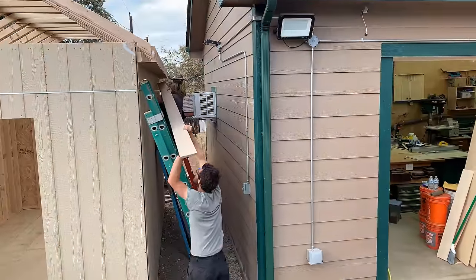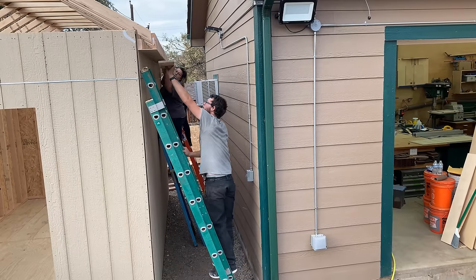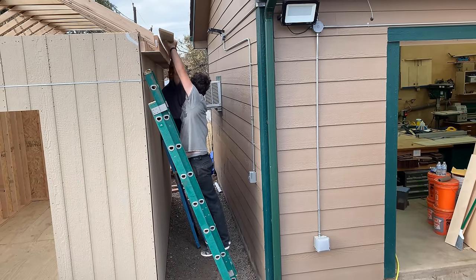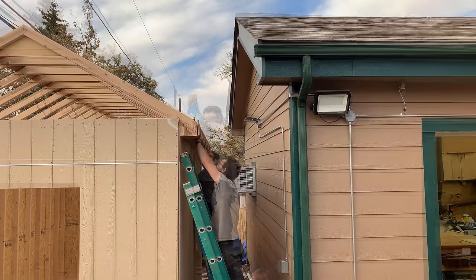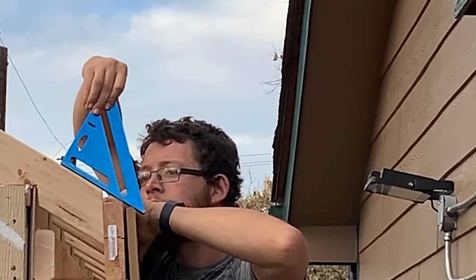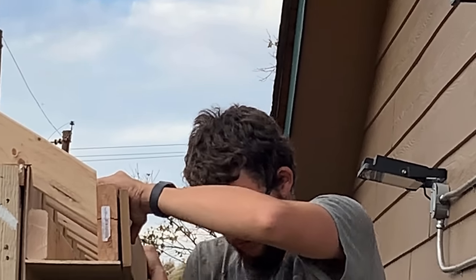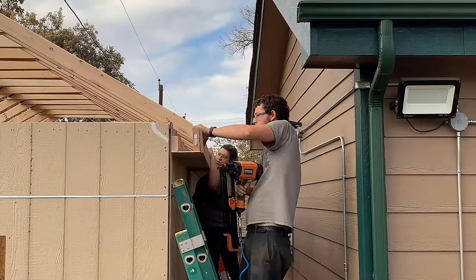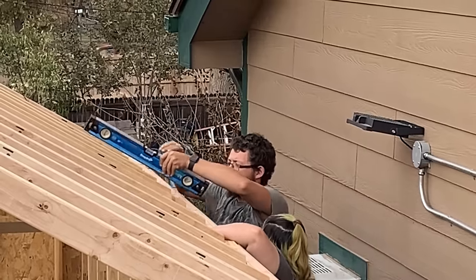After that we'll put up our fascia, which is a piece of one by six siding trim. It's going to go on top of our rim board and come down over the edge of the soffit we just put. It also does not come flush with the top of the rim board — it has to be offset downward so that the roofing goes directly over the top of it. We establish that offset using a straight edge or square, and continue checking the elevation of the fascia all the way down as we install the nails.